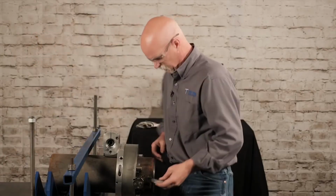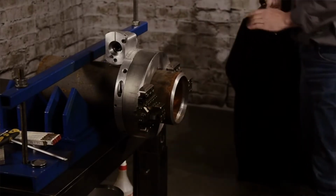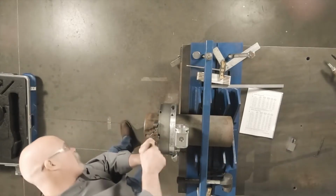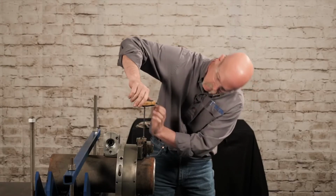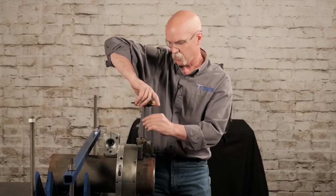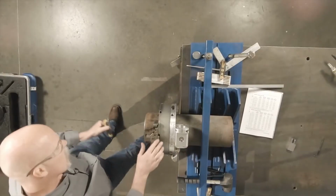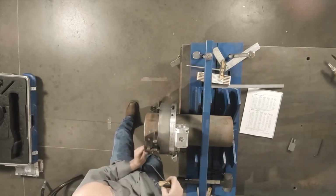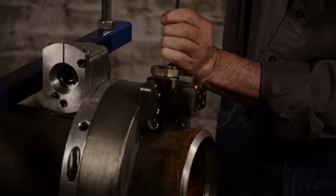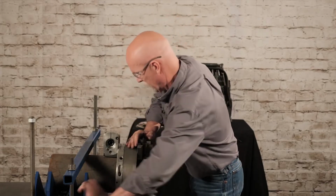Go ahead and put our bevel bit in. So we got all our set screws tight, we got a sever bit in, a bevel bit in. What we want to do is you want to come down, find your highest point of the pipe, touch off your tool bit, back it up 1, 2, 3 turns. You'll have to feed it back in, taking out the backlash, and line up your tripper pin sprocket on these lines. Your bevel bit, when you touch it off, you just back it up 3.5 turns. That way the leading bit, sever bit, is first. Take out your backlash, time it.